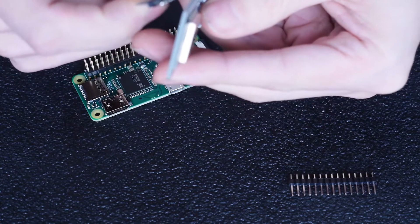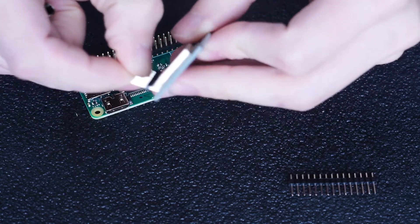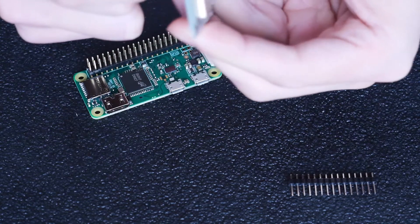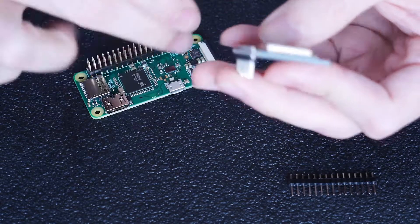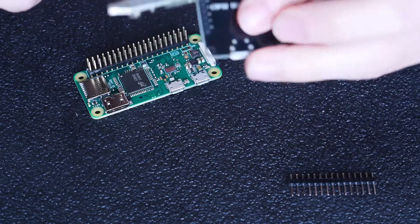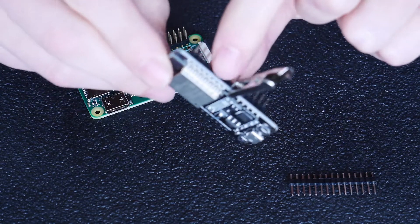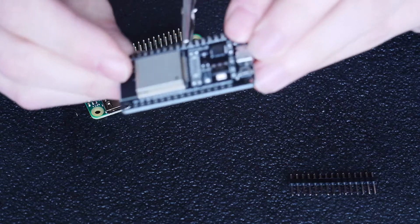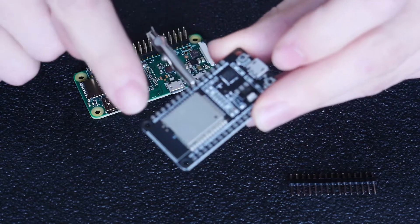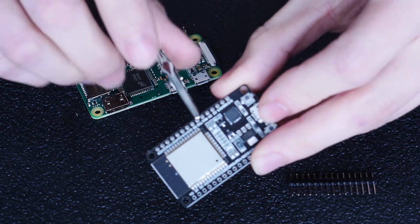Place the pins in — if you prefer to solder them topside, it's the same deal. Get your pins in there, and then just an alligator clip grabbing the backside plastic and the top of the board. Once you get a few pins soldered in place, I start from the two opposite ends, then the rest kind of holds itself.